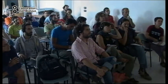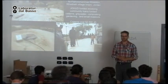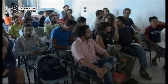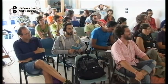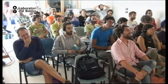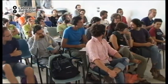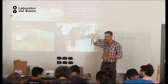You get cement made with fly ash, which is a waste product from coal burning plants, because that's full of heavy metals. So if you can, you want to buy cement that is rated for potable water collection systems. But this is not always easy to find. You can buy cement sometimes, at least in the US, that is rated for use for potable water tanks.